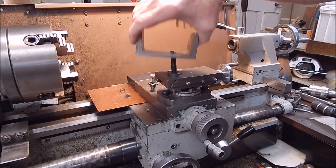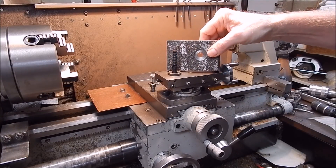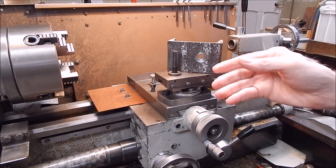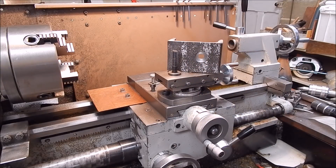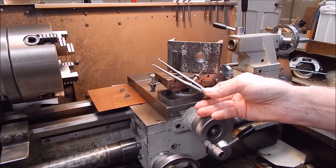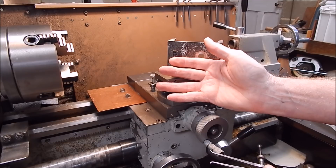So what's a quick trick to get this pretty much right most of the time? Well, rather than use measuring devices with readouts on them, what I do is what my father taught me — he was a mechanic and did a lot of machining. You use a pair of dividers, and then you trust your measurement to your fingers' feel.